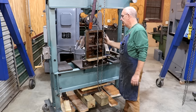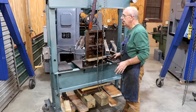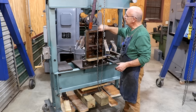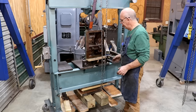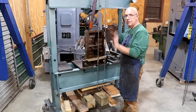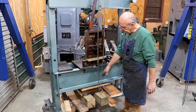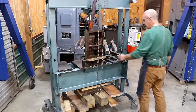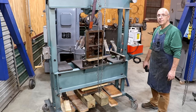I pulled off just the top part and disconnected it from the bottom piece so I didn't have to bring all the weight over. We picked it up using the engine hoist and brought it back to the back shop where the gantry crane is set up, and I moved the press back here underneath it. Right now this is suspended from the gantry crane, so it's not going anywhere. It's also sitting up on a couple of one-inch thick blocks on the bottom, with a parallel supporting it to keep it from tipping over. We've got 30 tons available — hopefully we won't need anywhere near that. I've got cribbing underneath so when that rod comes out, hopefully we can control it and it won't hit the concrete.